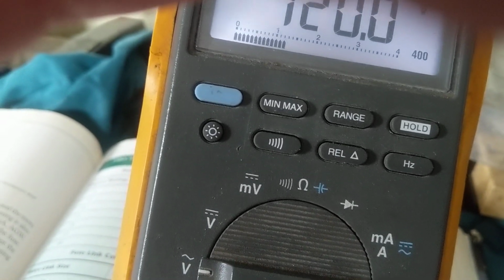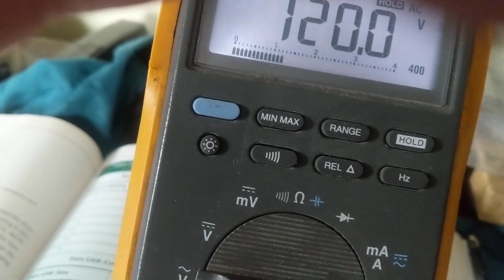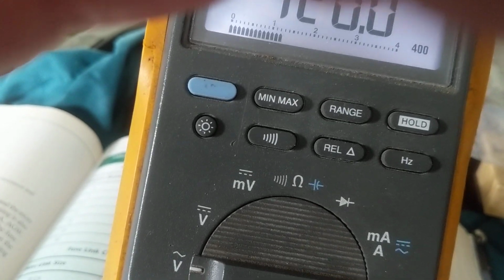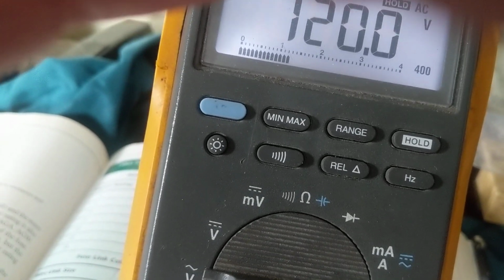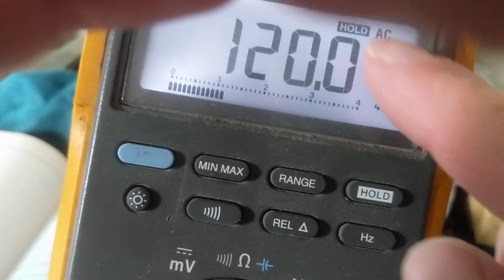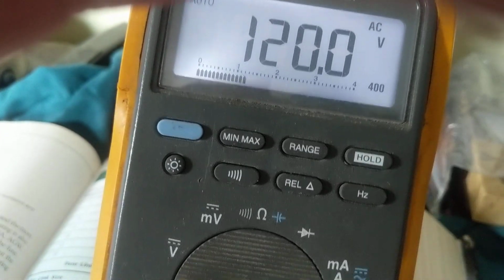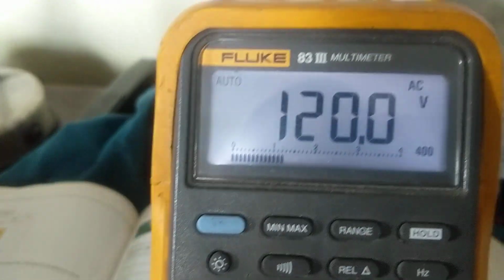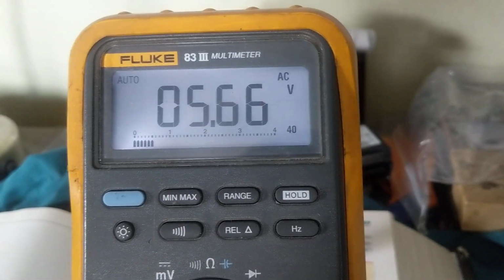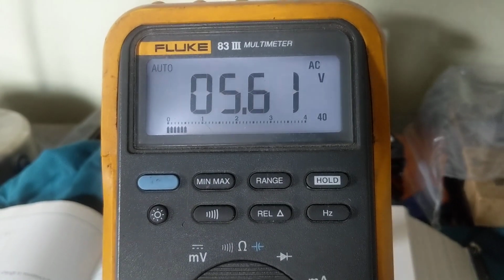If that measurement is supposed to be 12 volts, I tap it, take away the probe, because it's obviously a crowded area over there where the belts and everything are. It's a safety thing. Take away, and it'll still show me 12 volts. Why? I put it on hold. If I don't put it on hold, it's not in memory. What does that mean? Take away this, what happens? I lose the measurement, right? You don't want that. Okay?